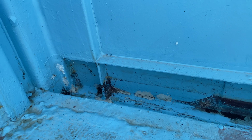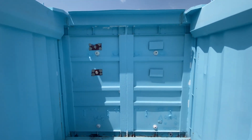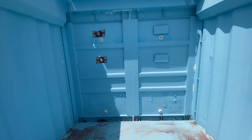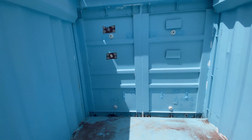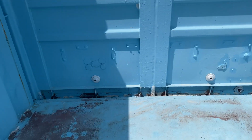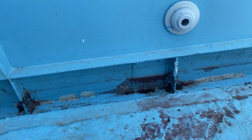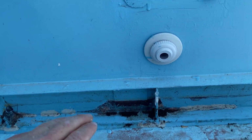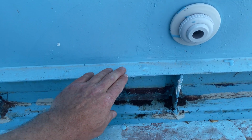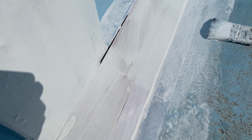This was a major issue last year, is these doors. These doors were definitely a major issue. They really flexed out. Now it didn't actually break much of the fiberglass that I did, but at the very bottom, it was just like constantly had leaks. There's kind of this pocket too, which was a little bit silly, that I'm gonna deal with. I'm gonna put a board actually that comes on top of this lip here, and then we'll come down to here, right across, and then I'm gonna do that membrane and the liquid rubber.